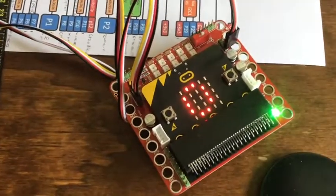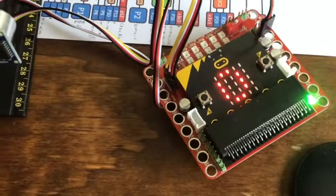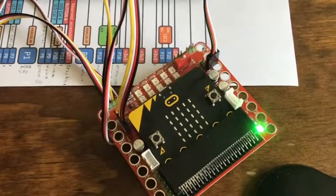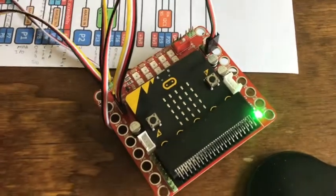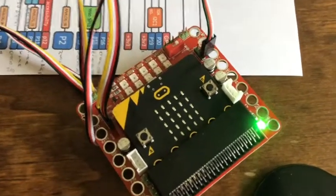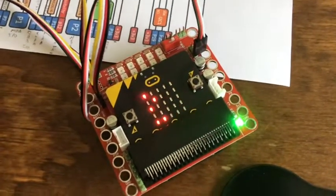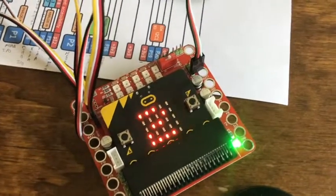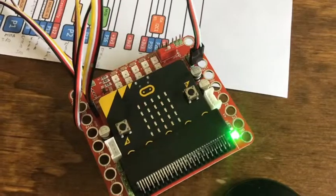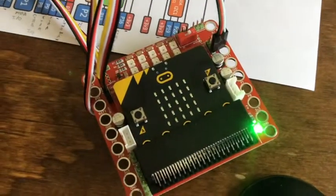It's reading zero now, which means it's not working. I wonder if 4.5 volts isn't enough and it really needs 5 volts, since it's spec'd as a 5-volt device — that could be affecting accuracy. At 30 centimeters it's reading 24, and without me moving it jumped to 27. My TV also has angled edges which could affect the readings. So it does work, but precision is a problem, and we'll need to look at whether we can actually supply the full 5 volts it needs.